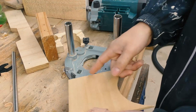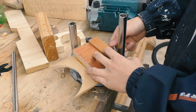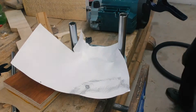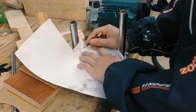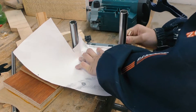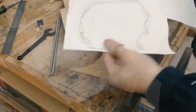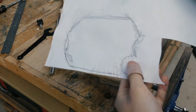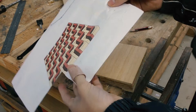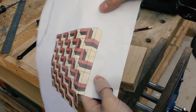To get the piece of wood to fit in the recess, you can't exactly put it over and trace it with a pencil. This is where a piece of paper comes in. We get some really clear contours of where it is, and it kind of transfers to the back — there are fold marks here and there that I can use as references.